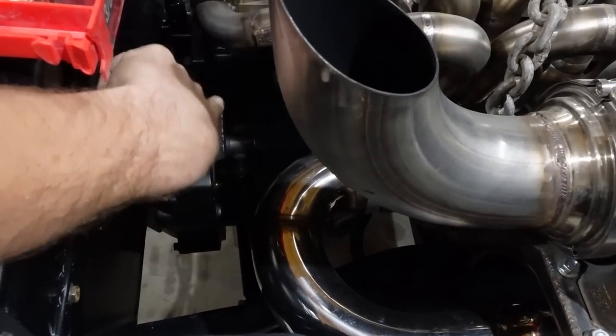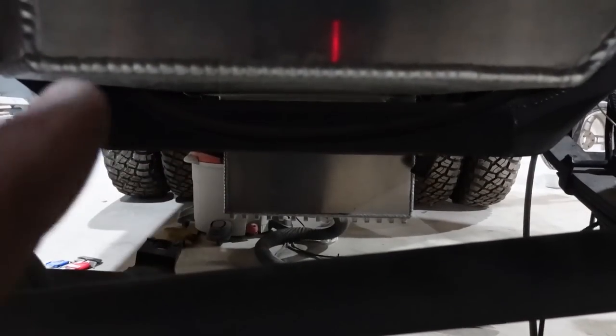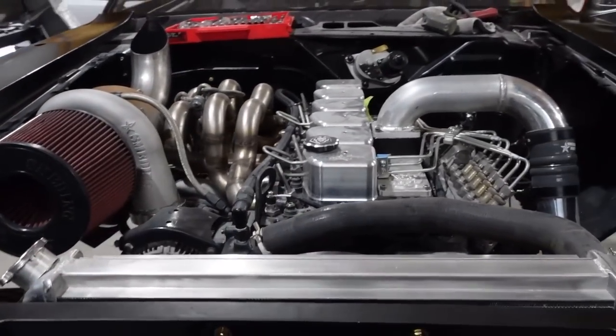I had to put in kind of a torque strap down there that's made out of a very heavy gauge piping. And you can see it right here. It's all isolated and it goes down in there. So that should help. Because before, the oil pan was not very even right here in this gap that you see. It was leaning down, which means it was crushing that motor mount back there. And these are 24 valve motor mounts. But I think just the weight of all this was pulling it down pretty hard. And so that's what that torque strap's for.